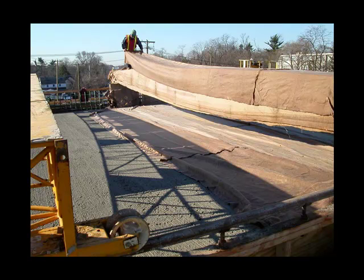Even when pouring a wall and reaching the top, you really can't walk away and leave it. You'll get better results if you cover the top of the wall, the top of the footing — whatever you're constructing should be covered, and the goal should be to retain moisture as long as possible. In many cases the contractor will strip formwork as soon as possible, perhaps within 24 hours, leaving the concrete exposed to rapid drying. If there is a compelling need to remove the formwork, the concrete should still be covered to create a moist environment and enhance curing.